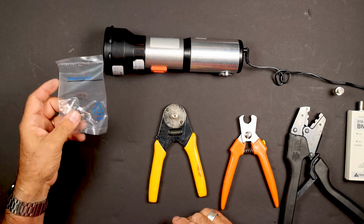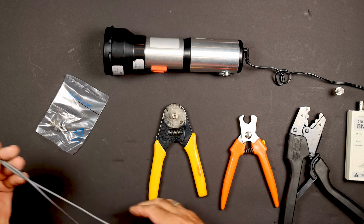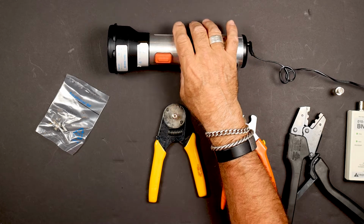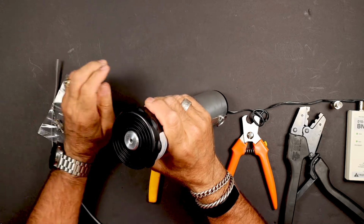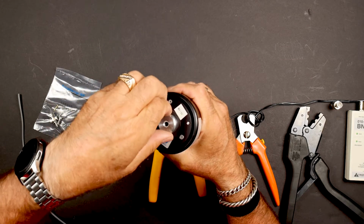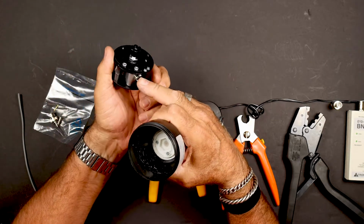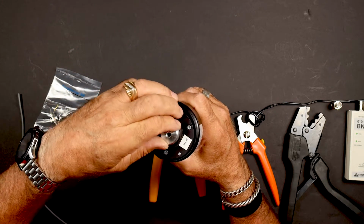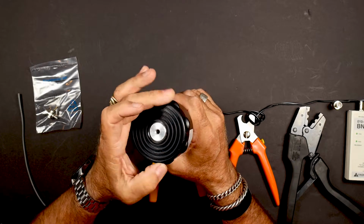So this is a BNC. Basically, we get our cable, and it's just a coil of this small coax cable, and this is what's called a Trompeter. This is an automated electric coax stripper, and inside here, if we take this apart, there are basically these little guys in here which have blades in them, and they spin around, and you can adjust the blades for the depth of cut for the 3 cuts that we need to make. And they spin it around, ring the coax, we put all of our hardware on there, and bada bing bada boom, we are done.